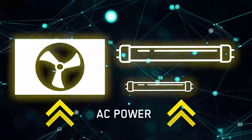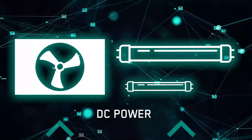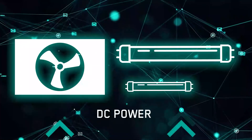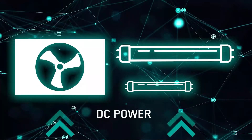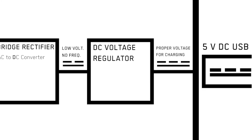That's five different components in one little charging block. So why are so many necessary? It comes down to the fact that your building has AC electricity running through its walls, but batteries need DC electricity to charge. So if buildings delivered DC electricity directly to loads, the only component you would need inside your charging block would be a DC to DC converter, which would step down voltage levels. So of course your charger would be more efficient if it didn't need so many components, but until DC power is distributed directly to devices, it does.